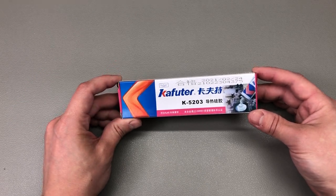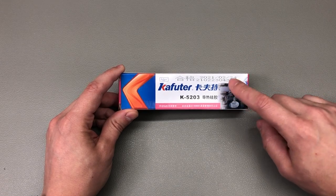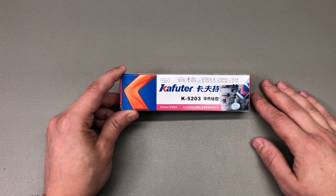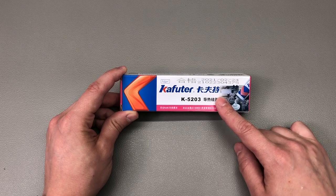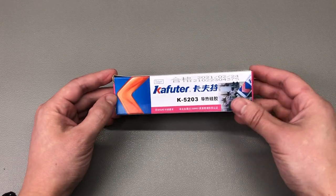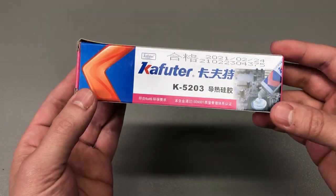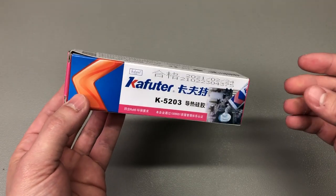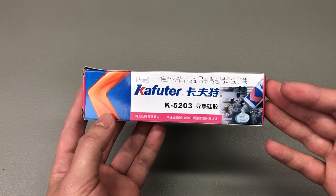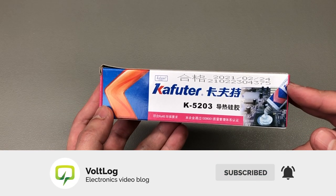I'm going to start this mailbag with a brand you are already familiar with here on the channel. It's very difficult for me to pronounce, but these guys make affordable adhesives and related products. I haven't had this one before — it's the first time I'm getting the K5203. This is a thermal adhesive; to be more specific, their description is 'reinforced thermally conductive silicone elastomer with great adhesion, insulation and dissipation.' It can withstand temperatures between minus 60°C and plus 280°C, and has a shear strength of 30 kg/cm².